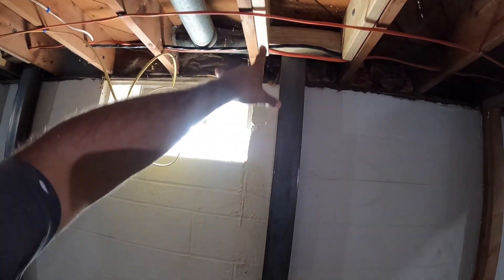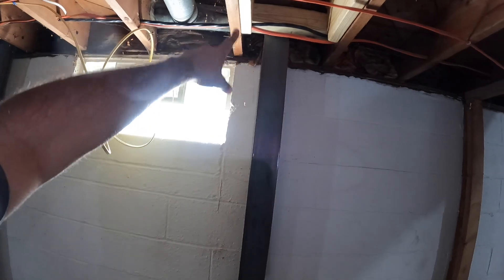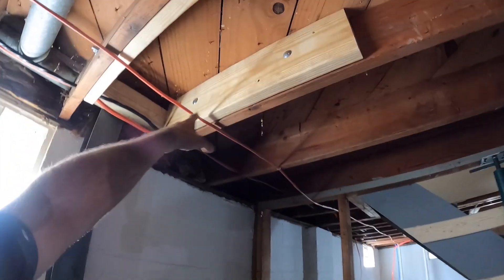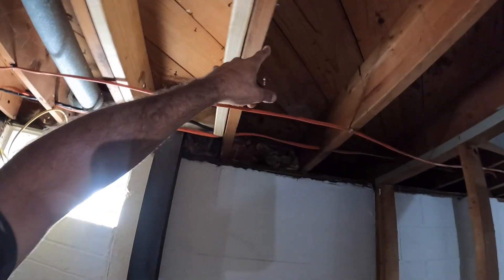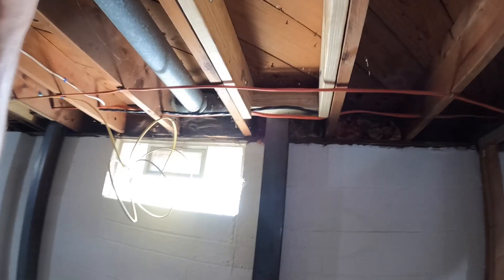Here's the top. I extended these beams a little higher because this wire runs right down through there. All these are cut about 30 inches. 2x8s on this one, with carriage bolts going through, holding them to the existing structure.